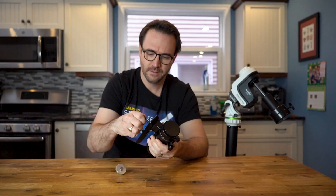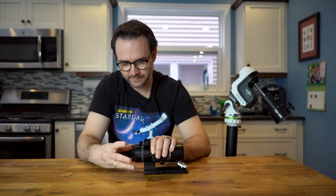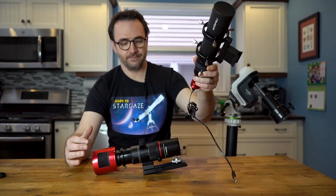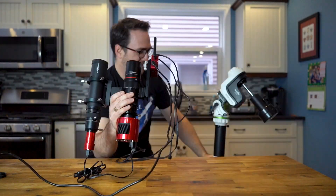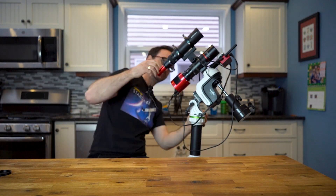The first thing I did was add a bolt to the top of the dovetail to hold my ASI Air Mini. Then I added a camera adapter, which I actually pulled off one of my Newtonian telescopes. I screwed on the camera and then attached my autoguider kit, which I just plugged into the USB port on the back of the camera. Then I attached the ASI Air. I mounted the rig to my EQ modified AZ-GTI mount and plugged in all the remaining cables.